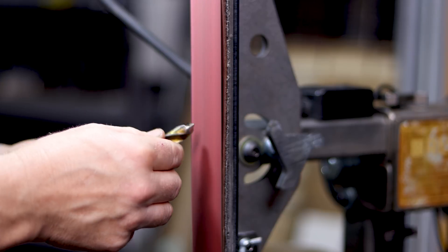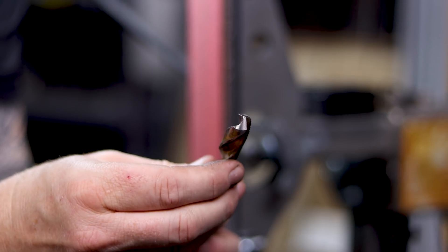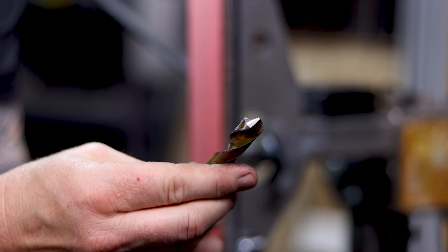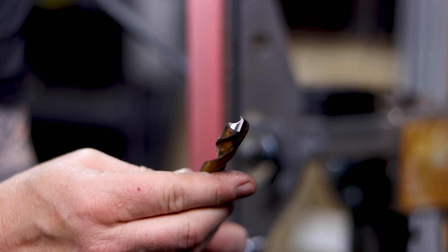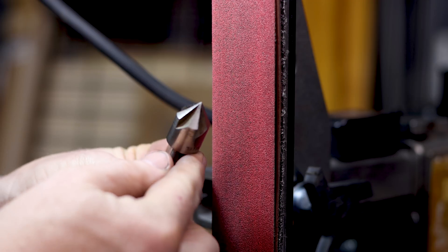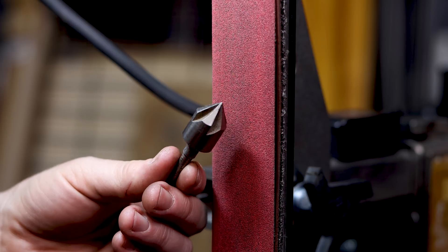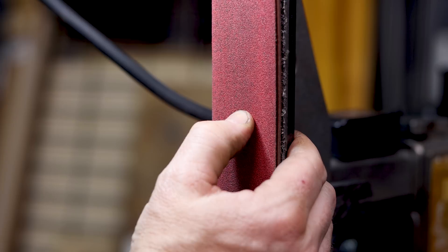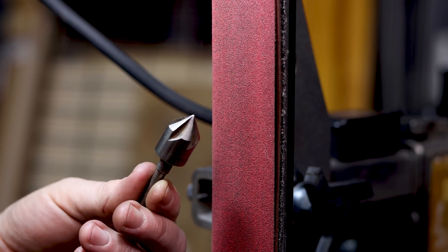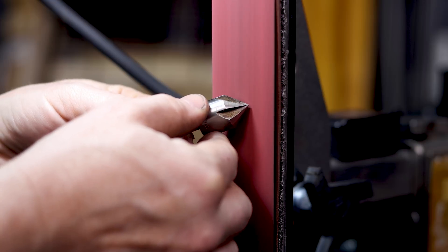Looking pretty good. You can also see the consistency of the light as it falls over the edge. If you've got a lot of faceting on there that's something you may want to correct — look at how the light falls over those curves. That's another reason why I like the soft platen: those curves just fall into line. One last thing — I need to put a sharper edge on this deburring tool. You can literally sharpen anything on this. I wouldn't sharpen chisels because the softness will round over the chisel — you really want a hard backer for that — but stuff with a round edge is perfect.